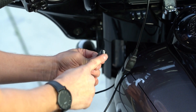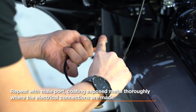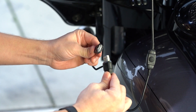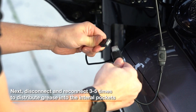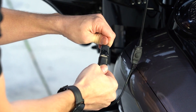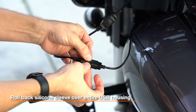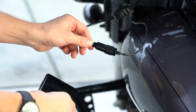Coat the female port with your finger or thumb and make sure it's well coated. Next, take the male end and do the exact same thing — apply silicone grease to all sides of the male USB Type-A connector. Then spread the grease all around with your finger or thumb, making sure all exposed metal is fully covered. Once both ends have been thoroughly coated, connect the two ends together — you'll see some excess grease come out. Disconnect and reconnect three to five times to spread the grease into the smallest corners and distribute it perfectly. Finally, take the rolled-up part of the sleeve and roll it back around the outer housing, evenly spread throughout, so the silicone sleeve covers both halves of the port for the most enhanced waterproof connection.